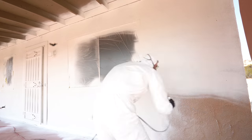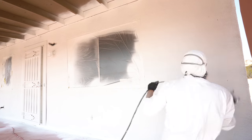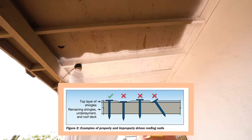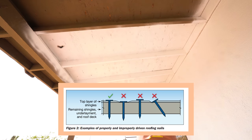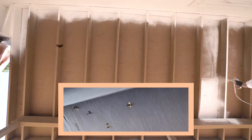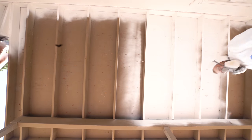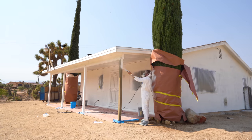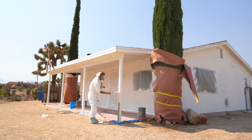I know it looks like a big block of white right now, but just be patient — in the future I'm building custom wooden shutters, doors, doing all types of landscaping and adding pops of color throughout. My front porch has one of those ceilings where roofing nails are sticking through because whoever installed the shingles used nails that were just too long and they poked through the decking. A paint scraper with a wire brush did a pretty good job of removing any paint that wanted to fall away, but I didn't want to be too aggressive since the majority of it did have a good bond. It's not the most beautiful texture in the world, but it's a whole lot better than how it looked to begin with.